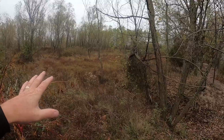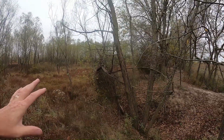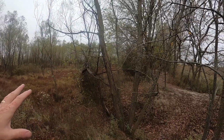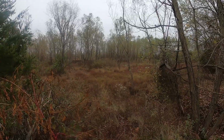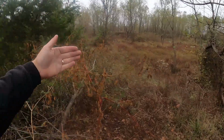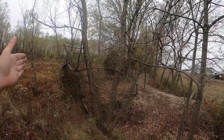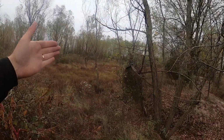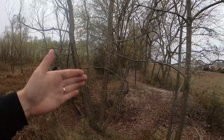It still appears to be relatively dry right now, because we've been in this drought. So my hope is I can get the D6 in here, strip all this weeds and sod off of here, and then I want to start pushing that dirt back up on this dam to widen this dam out all the way down through here. It will make that pond deep over here again.